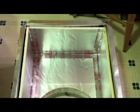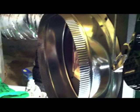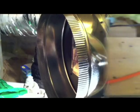I bought some of the equipment from a local HVAC contractor, including the round transition. Here I replaced my return duct work with a 16-inch duct and attached it to the side of the unit with a box. Here's what I attached to the existing supply box where all the duct work comes into the house. I got Ingrams to supply what's called a duct takeoff to attach to the side of the unit. I installed a new disconnect switch in my crawl space and ran a 10-gauge wire to the unit for power.